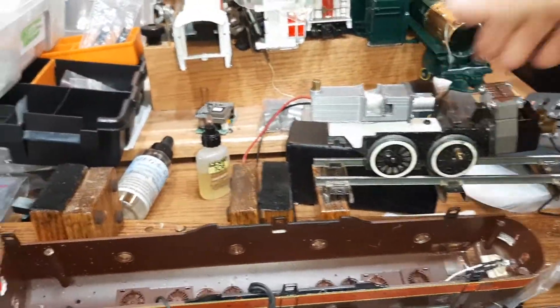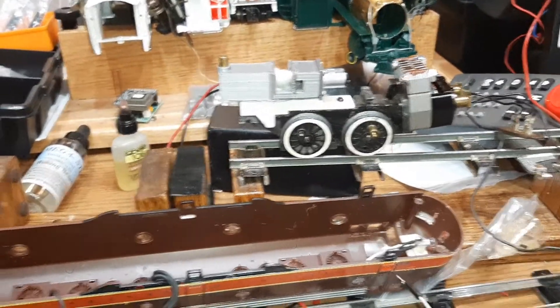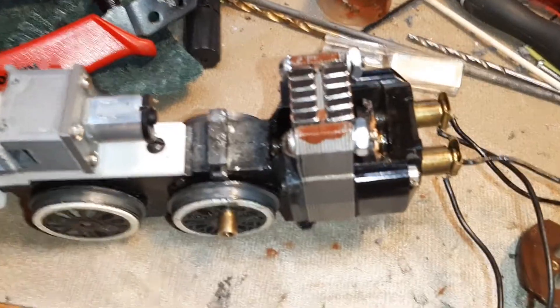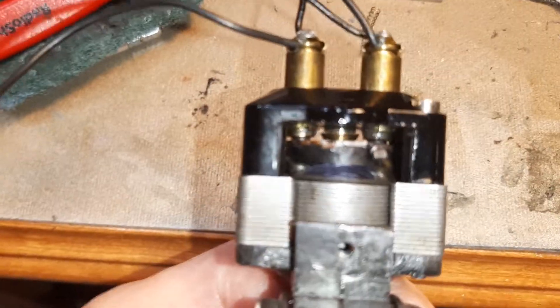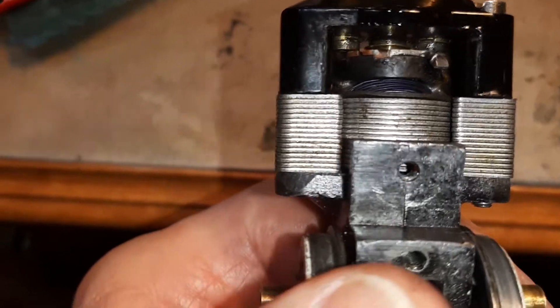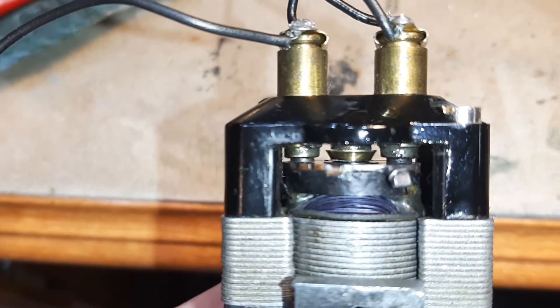I built this a long time ago, and I was never really happy with the running of it. I found two things that I changed just this morning. One was the backlash — it wasn't set actually. When you pull the wheel forward and back, you can see in normal engines the motor moves a little bit. Here it doesn't move hardly at all, because I've shimmed it just enough. There, you can see an air gap that disappears right there.